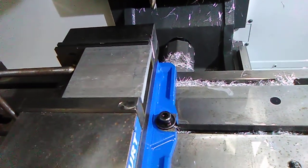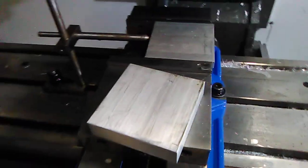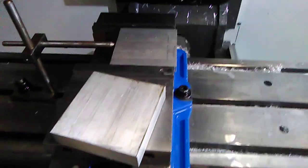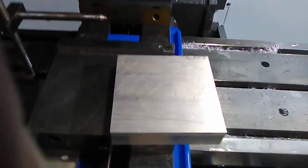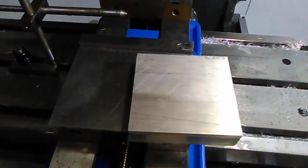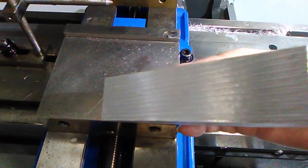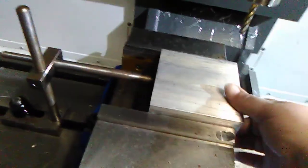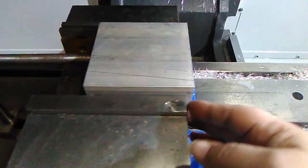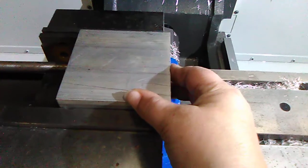And we're gonna work on the body because I have it set up in the other program. The other machine, I mean. Here's the 4-inch stock, and here's the cut end where the blade cut. So we're gonna place the stock side against the chuck and my stopper. We're only trimming a little bit, so you can just have a little bit sticking out. It's fine.